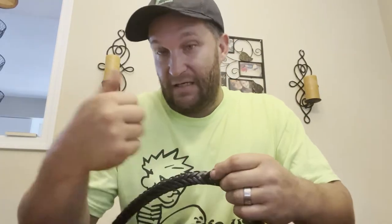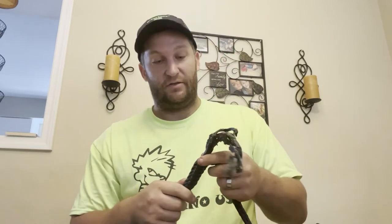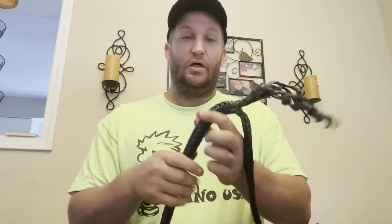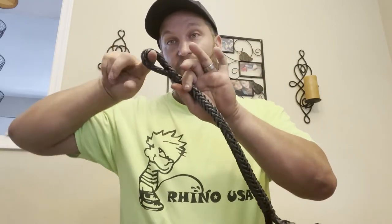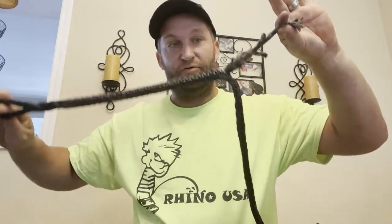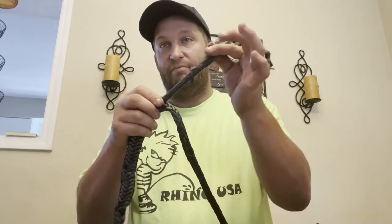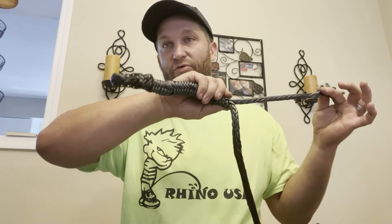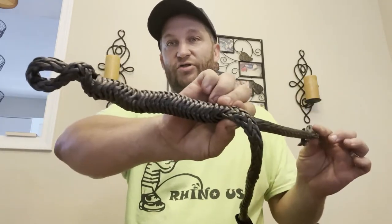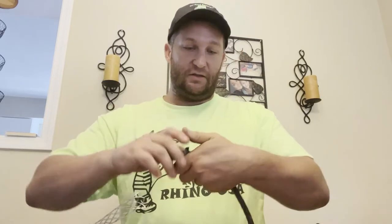Had to take that call — somebody's got a 30,000-pound excavator stuck in the woods and needs help getting it out. Anyway, tighten it down from the noose and pull. If you make a mistake and didn't go quite far enough, that's fine — let me show you how to fix that. Take your tag line here and pull it back through. It's going to pull the noose and everything and scrunch that cable back up. Put your FID back on.